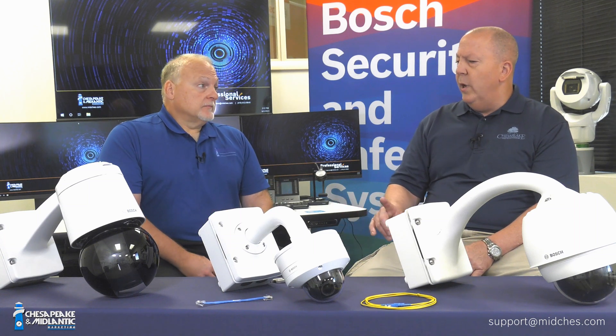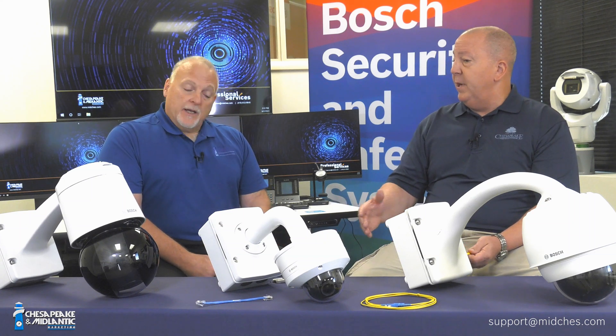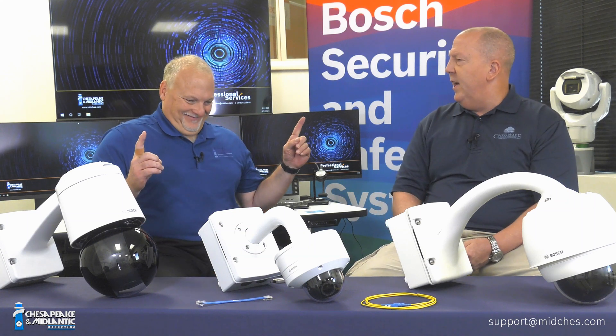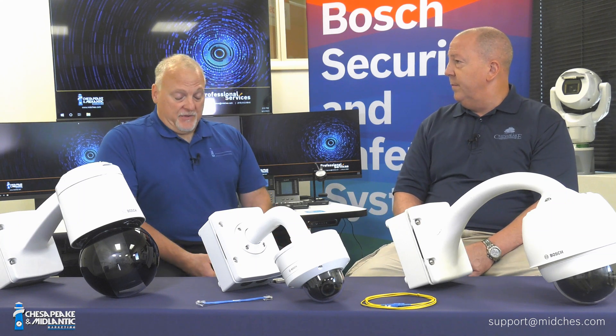Which is a big deal when we talk about changing old analog systems over to IP. We know right away there's a big difference, because back when we were using coax, we had that 750 to 1,000 foot distance, and then we go to IP, that distance has become limited to 300 feet. So with fiber, you can go much greater distances.